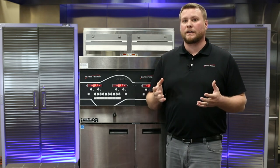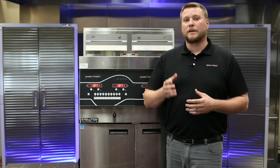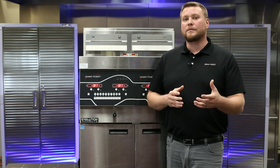So we covered a lot of different things here. We talked about number one, if our filter pump motor doesn't come on when we energize it — possibly our pump motor relay, or on electric models, our VAT number one power cord and white circuit reset breakers. We also talked about a scenario where we don't have suction versus if we do. If we did have suction at the plug and play connection, most likely the problem is going to be in our filter pan or possibly related to those three black rubber O-rings. If we didn't have suction, we talked about checking the pump or possibly beyond the pump with check valves. If you found this video helpful, remember to check out our other troubleshooting videos as well as part replacement videos. Until next time, stay safe out there.